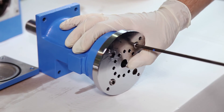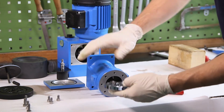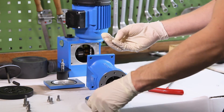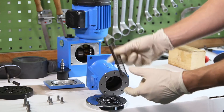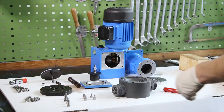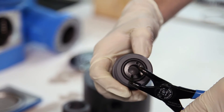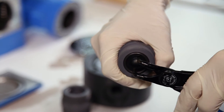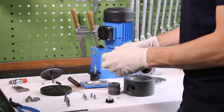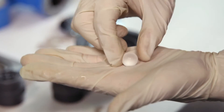To change the spring for the piston, you have to unscrew the fixing plate. Finally, the non-return valves are loosened and the valve seats are unscrewed. The ball, the seat and the O-rings can be disposed of. If there is a stop, it is replaced as well.